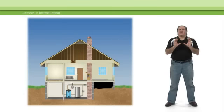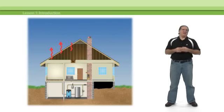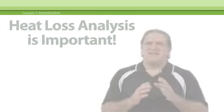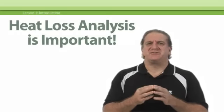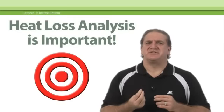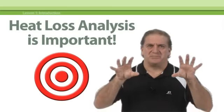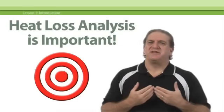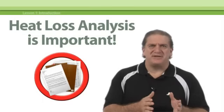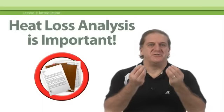This may be an oversimplification, but building any hydronic system has to start with a heat loss. You've got to calculate the heat loss of the structure, and for that you've got to do some math, or at least know the reason your calculator is spitting out the numbers it's spitting out. It's important to do a heat loss analysis for two reasons. First, it establishes a clear target for your heating system so you know what you want to achieve and what you want to put in. Second, it creates documentation for your customer so the homeowner understands why you're recommending a certain approach and why it's a good value.